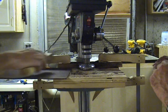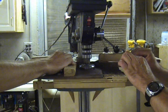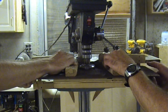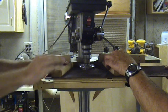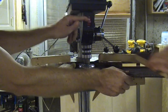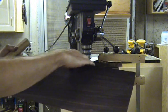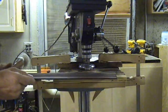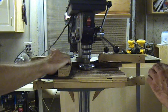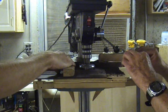On wider pieces of wood like guitar backs it is necessary to move the fence and make two more passes with the safety planer in order to thickness the entire piece. But before I do that I am going to make a couple of passes on the other piece of my two piece back. Just like on the first side I am going to flip the piece around and make one more pass. Notice that I am using just an ordinary 12 inch bench top drill press with the safety planer. It is not necessary to spend a lot of money on your drill press.